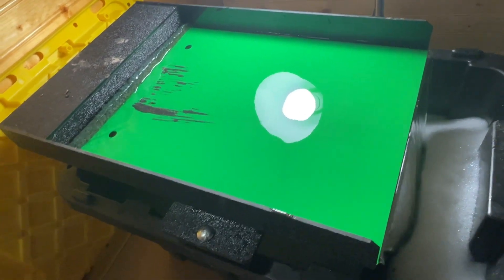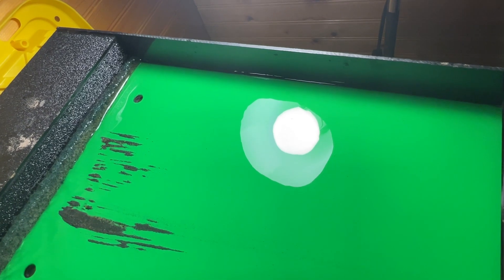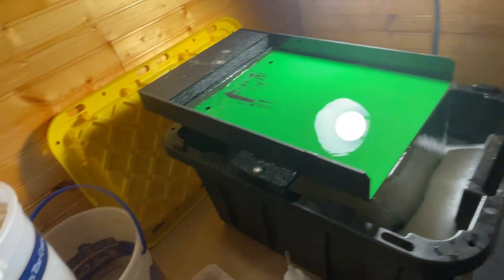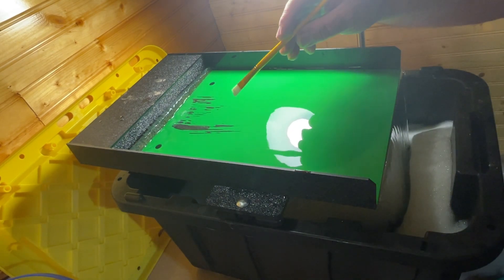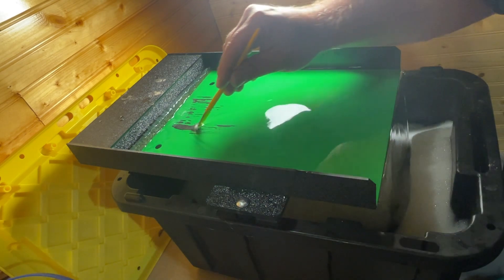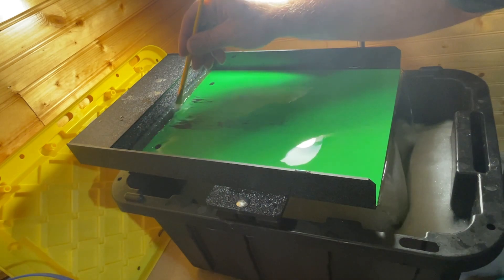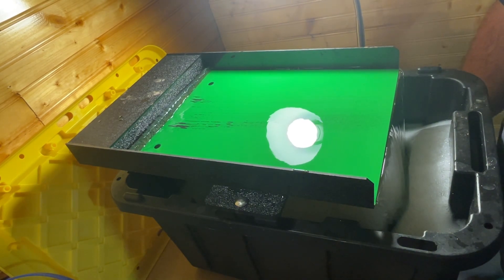You can see that in the action here — you've got the stream of material getting pulled across. Widening out from up there, you see the long streaks from the water flow pushing the material away and off into the bottom and into the catch pan. One of the nice things about miller tables: if you get to a point where very little is happening, you can take a paintbrush, move everything back up to the top, concentrate it again, and it also breaks it up a little bit, allowing the water to capture the light stuff and move it off the table some more.